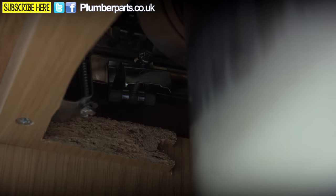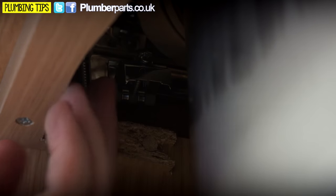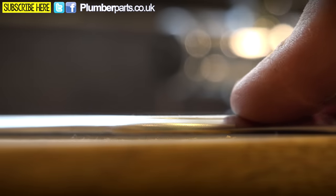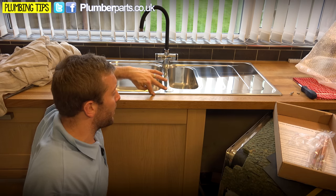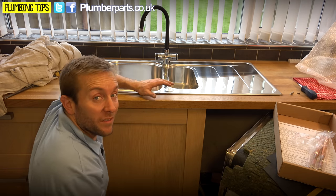Now go back underneath and get all your clamps tightened up to make sure the sink is nicely fixed. Flip the clamps down. Sometimes you'll find they're not going to get a grip on anything — either they haven't got long enough screws, or it's just not what's going to happen. In that case, your best option is to use silicone and weigh down the sink, leaving it for a day so it glues down properly. On this one we can get a nice clamp on there — screw it down so it clamps nicely. Now we've got the sink on, I'm going to put a nice small clear bead of silicone around here just to make sure nothing gets into the cupboard.